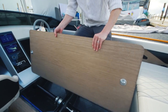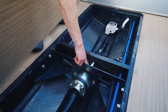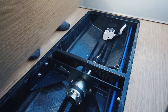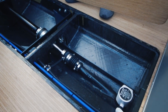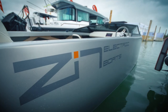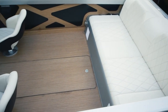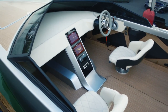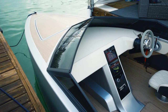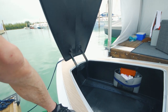So this is our drivetrain — this is the big part of it. You can see this big thrust bearing. This is actually what takes all the torque and keeps the shaft from pushing into the motor. When we say all carbon fiber, the boat is all carbon fiber. Light is right — the hull weighs less than 350 pounds. The carbon motor cover weighs 125 grams. Even our hinge is carbon fiber. We build it to keep it light and stiff, just like every other part of the boat.